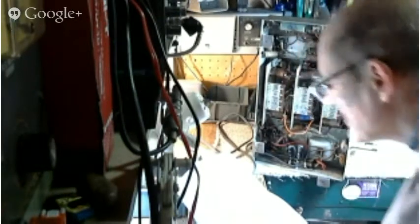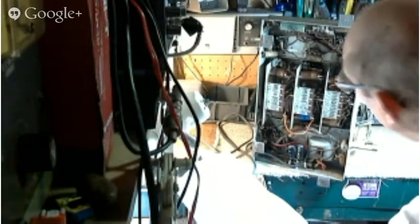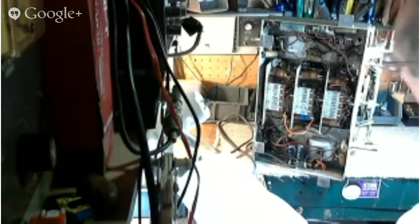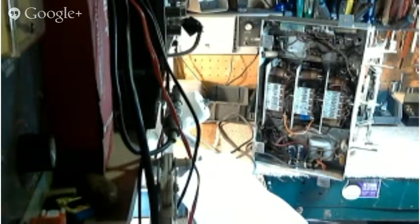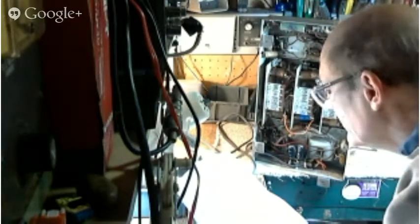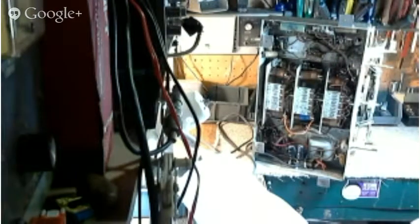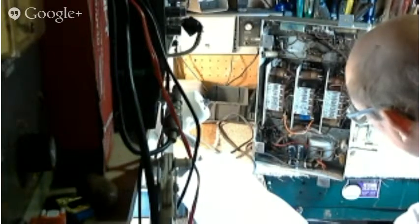So usually there's an oscillator control, and then one or two RF stages that are tuned. The oscillator adjustment literally calibrates the front scale pointer. And the other two increase the Q of the initial RF circuits, which gives you a better, cleaner signal at the far end.